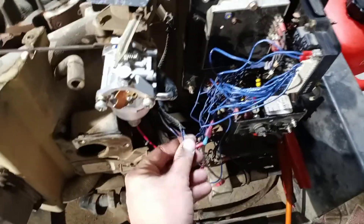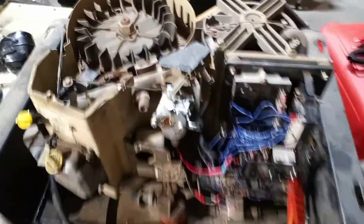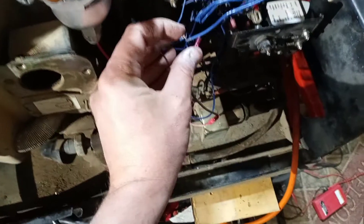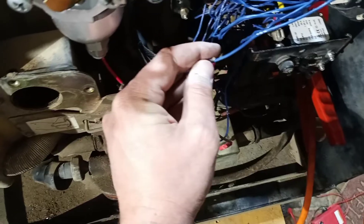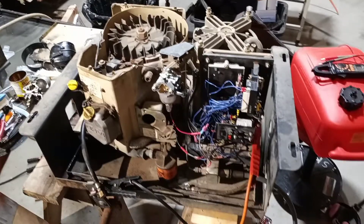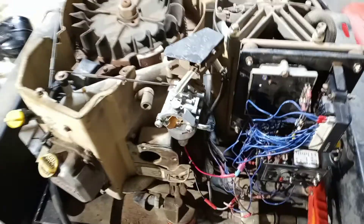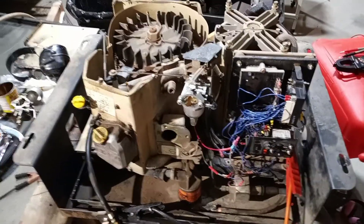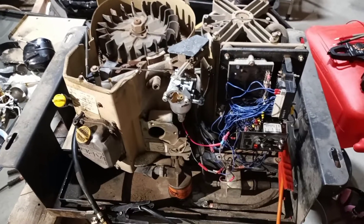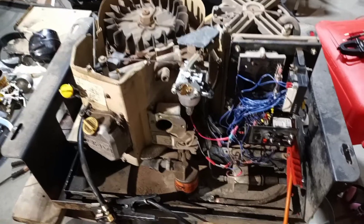Mine was always shutting down immediately as soon as it started, so I just cut that wire. After cutting it, this thing just runs along with no problems at all. It does mean that to shut it down you have to remake that circuit and press the shutdown switch, but at least you can test whether you have a bad control board or not, once you've eliminated the pressure switches and high temp switches by testing for open circuit at operating conditions.